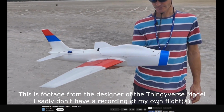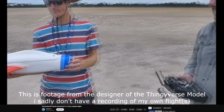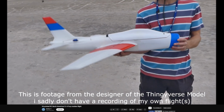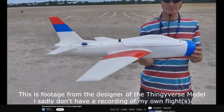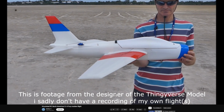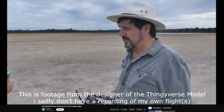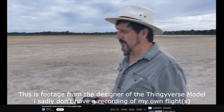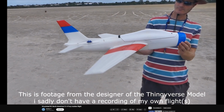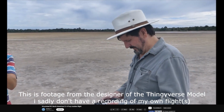It has about 1 kilogram of thrust with a fully charged battery and weighs about 900 grams, so when the nose goes right up, it can actually slowly climb. However, it was very slowly falling over, and so it quickly went from sort of hovering to slightly landing on its side like a SpaceX rocket. Because it was landing with such a slow speed, there was actually very little damage done to it from this crash. The only damage was in one of the wing parts, and the damage was very quickly repaired with superglue.